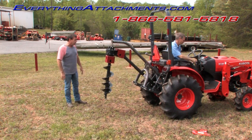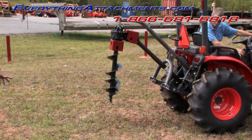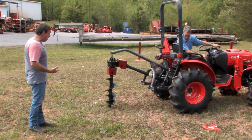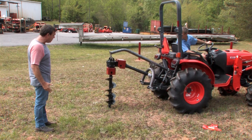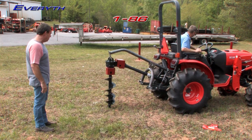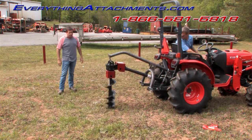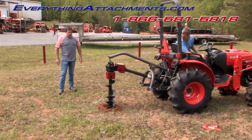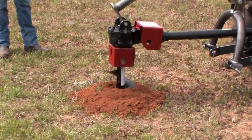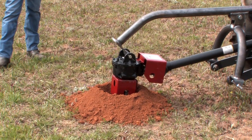Go ahead and crank it up, set it down, and let's see how this works. You should always stand way back from a post hole digger. The bit's pretty vertical. Set it down — you can back up or down easily with a hydrostatic tractor, which I think all B and BX's are. You probably have to give it a little fuel. These are the same types of augers, just shorter, as we've been using for years on our Everything Attachments equipment. It's pretty dry here, it's red clay, but it is dirt. People say they wore out a set of tips on the first day and had to pour water in the hole — but these are meant for dirt, not for rock.